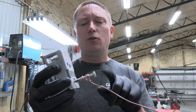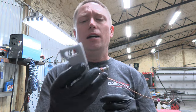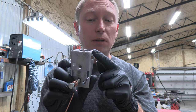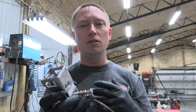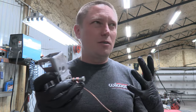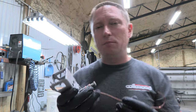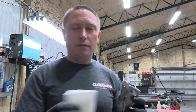The reason I've attached my copper wire to a bolt that goes into the part — rather than directly onto the part — is because it's very common that where the wire touches the part directly, it won't want to plate. You'd have a little spot where it was touching and as a result no zinc ever gets onto it, and it would start to rust at that tiny location and propagate. There are ways to get around that by jiggling the part halfway through to move the wire to a different spot, but attaching to a bolt is really the better way to do it.